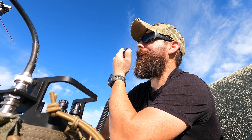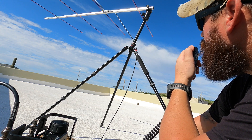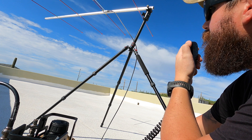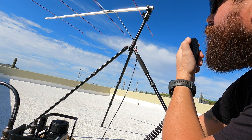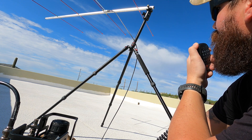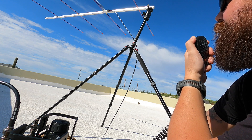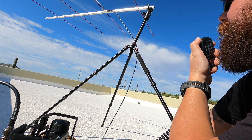I try to stick around for as much of the net as possible. Net control continues check-ins — K7EME and WD7R good morning, that's Mike, our local two meter SSB net control operator. I let the net know I'm recording a YouTube video and that it's an Arrow 2 four-element on two meters running horizontally. For rotation I'm using the GPS compass on my watch and looking up call signs to rotate to the correct bearing, making slight adjustments for the best signal.